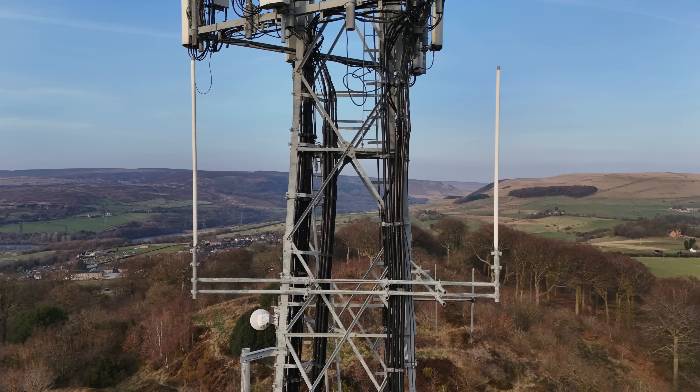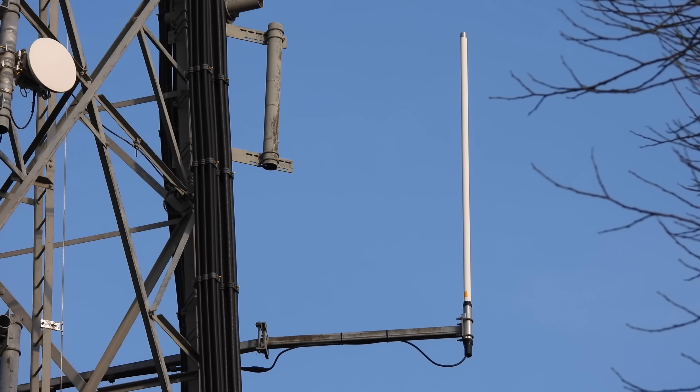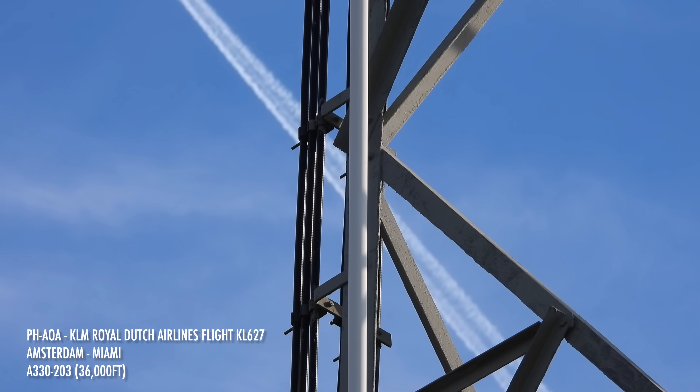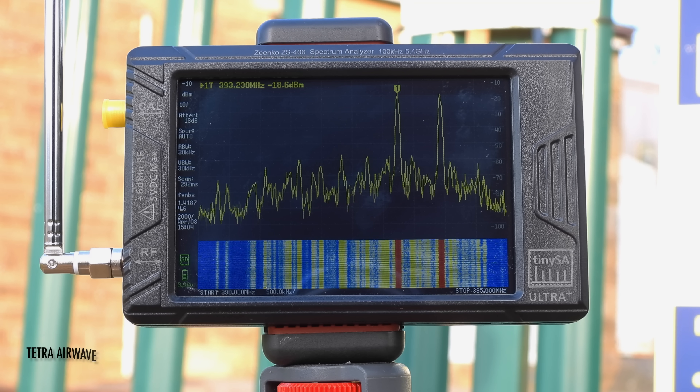At the same level we have three of these white antennas, which are Tetra Airwave — the police's radio system on UHF. While they tend to use four-stack dipole arrays in groups of three, they often use these white stick antennas instead. There are another two near the bottom of the tower too. The police network is extremely complex — I've covered this in detail in a video I'll link below — but it's clear to see the two different signals from the two sets of antennas at the midsection and bottom of the tower.